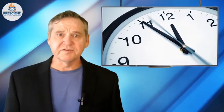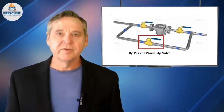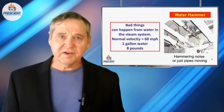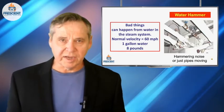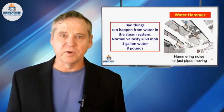Sometimes steam systems are designed with small diameter warm-up valves and bypasses around very large diameter valves. You've got to have instruction and a plan for how the steam system is going to be put into service — it's never just about throwing open a steam valve. Even when closing valves, you should do this very slowly and gently. This applies not just to steam piping systems, but also to condensate systems. The entire time these startups are in process, there have to be people listening for and observing piping systems for evidence of water hammer, where water is being picked up and accelerated — a very dangerous condition.